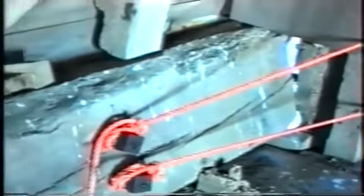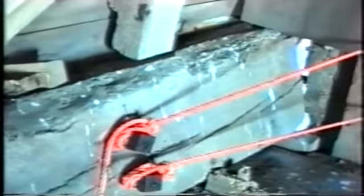Joint between the left-hand corner post and the forward end of the side girt. Awful lot of daylight through there. You can see that what remains of the side girt is rolled outwards. Crown tree with the side girt. As you can see, there's practically nothing of the side girt left. Now this side girt has had plates on it at one time which have been removed. You can see the bolts sticking out, the nuts on it.